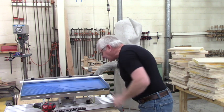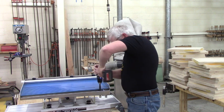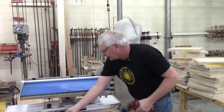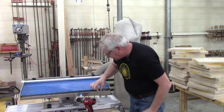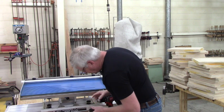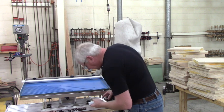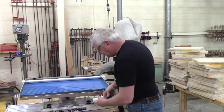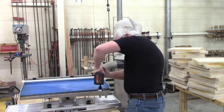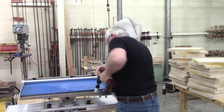This one here is a little tight. Looks like I'm going to have to put a five-eighths drill bit in there to make it fit. Slow it down a little bit. All right, that's carved out of there. Now let's see if my bushing fits. Perfect. I'll go ahead and put this inch and a quarter hole saw in here. This is a newer one but it's struggling a bit, so I'm going to grab this sharper bit and see how it works.